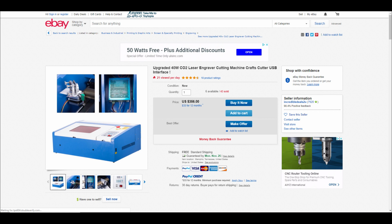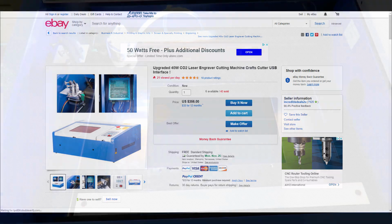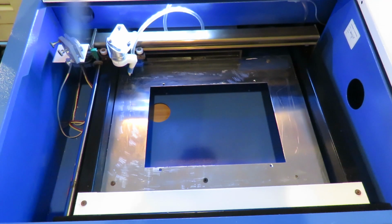In this video, I'm going to show you how to create your own registration marks and engrave them onto your own laser. For this exercise, you will need some masking tape, I used white, the laser rule guide SVG file from Thingiverse, the link is in the description, some cleaning agent such as Awesome Orange, and a commercial degreaser such as Goo Gone. We prepare the cutting bed first by cleaning it.